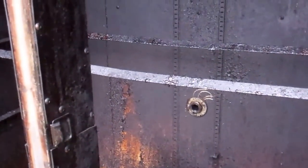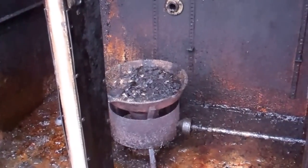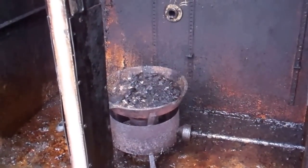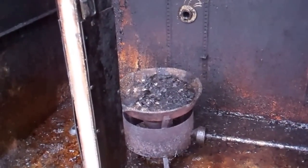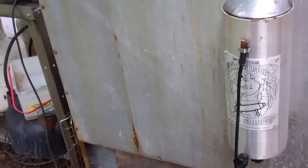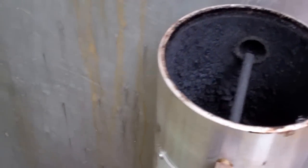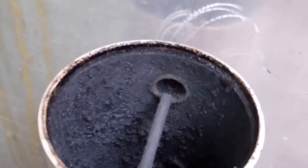My brother Steve was awesome — he sent me what's called the Smoke Daddy, and it mounts right through the wall of my smoker here. I can start smoking fish or anything and maintain around 110 degrees, getting a lot of smoke going without cooking it right away. I can adjust the burner real low. I'll put a link under the video. It uses an air pump that hooks right to the end of this hose, and inside is a little venturi — a small tube that shoots just before the hole and creates a vacuum.